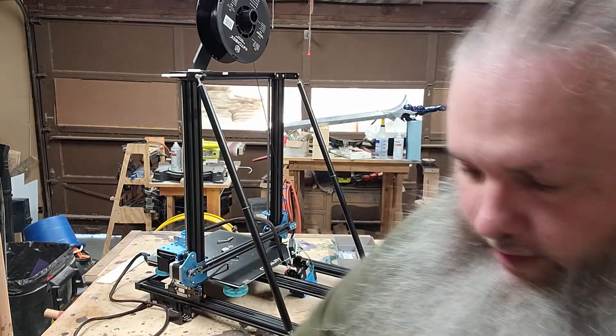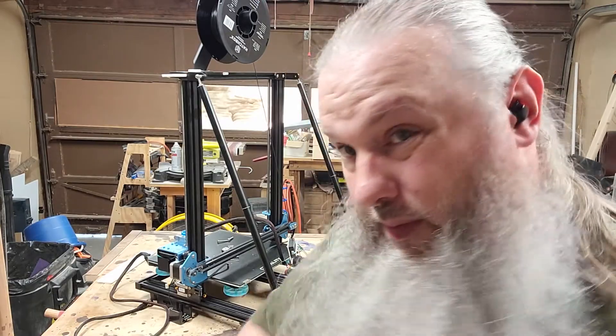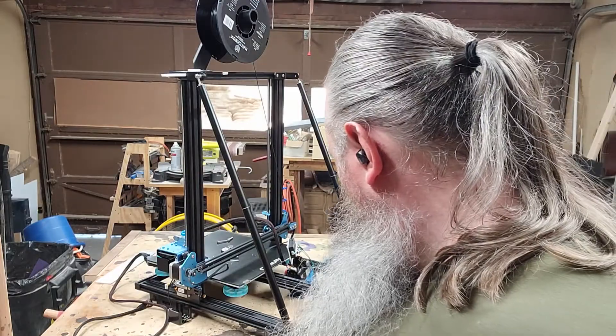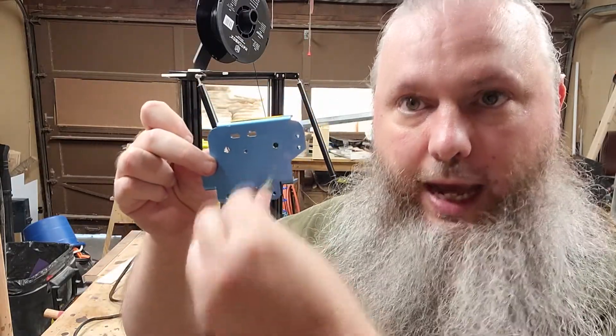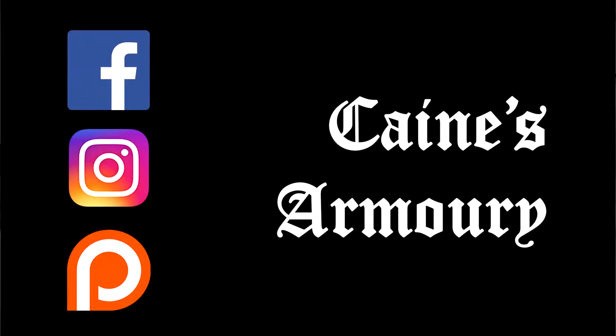Now, while I get this pulled out — this is just your standard roller. It's kind of gunked with some stuff in there and we're going to need to clean that out, but I'm not using that. This is the eccentric nut, and this is called a mounting plate. Every printer has one. It is basically a set of pre-drilled holes for your hot end. This is what I 3D print and mount to — a new mounting plate or adapter plate — so that I can fit the Hemera, and that is what I'm playing around with right now.